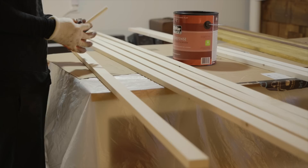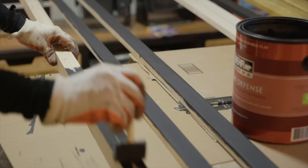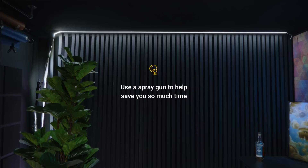Unfortunately the time of year I started this project was very cold and didn't allow for painting outside, so I had to paint all 60 slats by hand one at a time instead of with a spray gun. I used the paint color Limousine Leather from Home Depot and a foam brush for all the painting. It was tedious, but I was able to control any drips or imperfections. Tip: if you can use a spray gun, that would save you so much time.